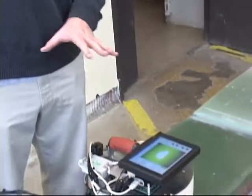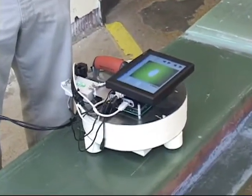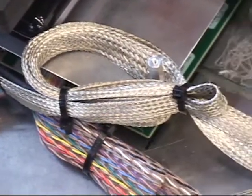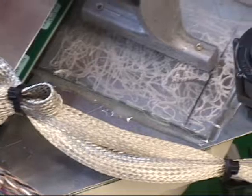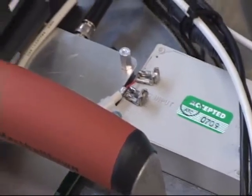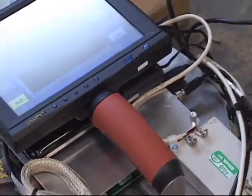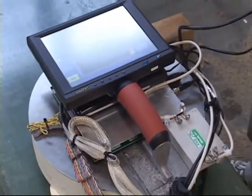The goal here is to inspect the glue joint on an I-beam structure that's glued together in a blind fashion, so we're not able to see the actual glue joint as it's being laid down. Normally this is done with ultrasound, which can take up to 10 hours to complete and requires water to couple the ultrasound into the part, so it's quite messy and very labor-intensive.